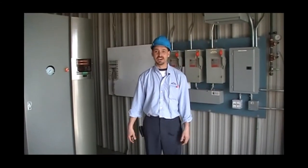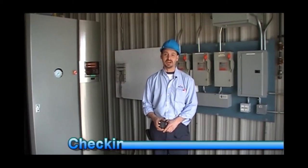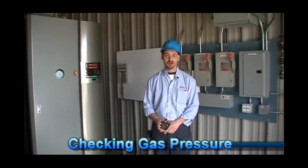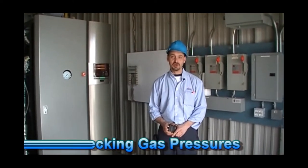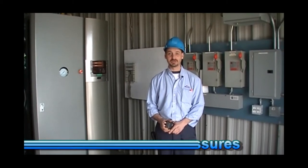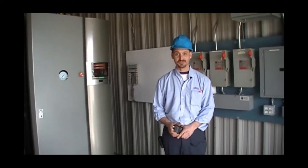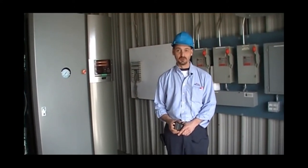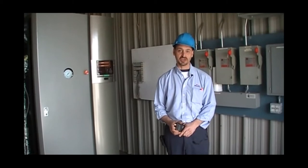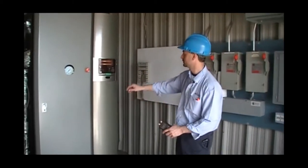Thank you. Hi everyone, now that the safeties have been completed, our next step is going to be to measure our gas differentials, our manifold, and combustion. Now it is a normal procedure for Miura's recommendations that the main gas orifice differential pressure be considered the most important and the manifold be used for a quick reference check only. So we will start with high fire first.